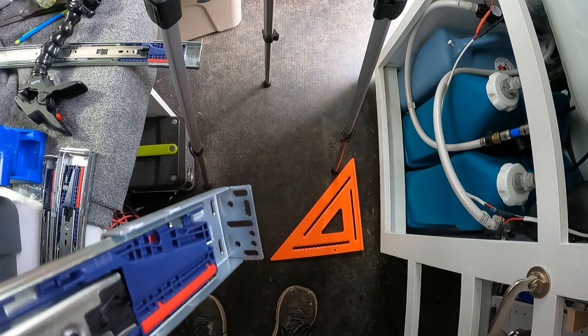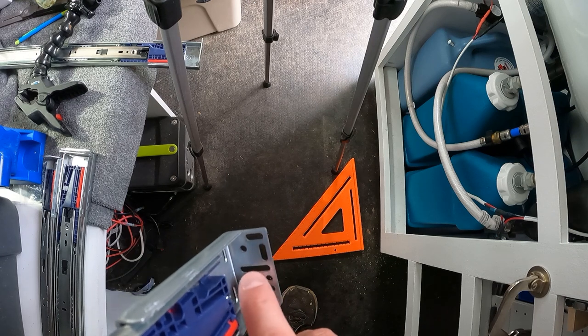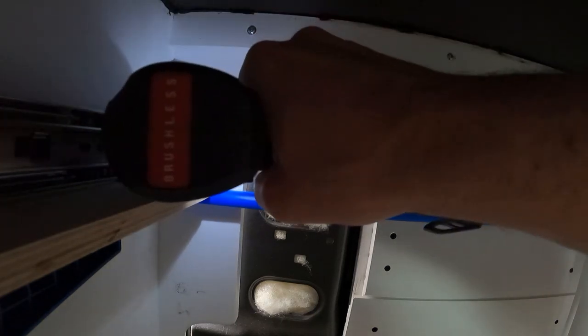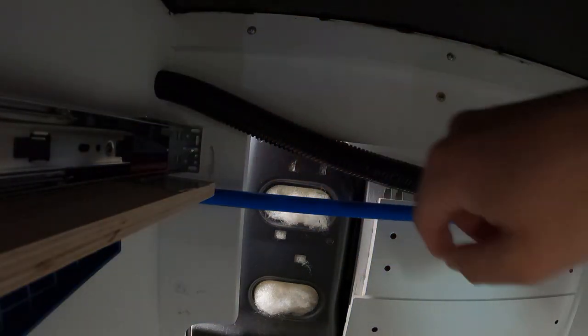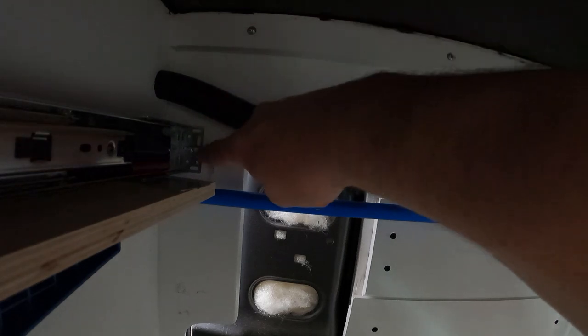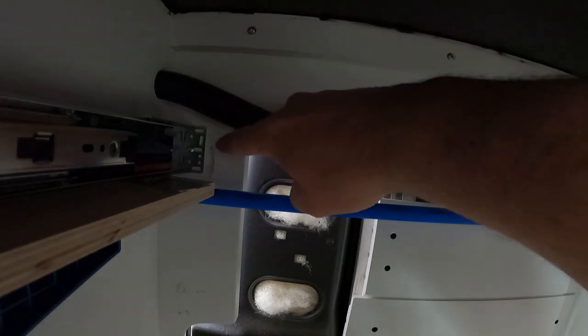When we go ahead and screw in the bracket, there are these extra long slots in the bracket in the back. Using the one in the middle, you'll have play on the screw head as long as your screw is not tightened down all the way. We'll go ahead and put a screw in that middle track, trying to keep it somewhere in the middle and not tightening it down all the way. As the drawer goes in, you can see it goes back and forth within that track. The height is pretty much set, but the side to side play with that track will allow us to adjust. Once we put the drawer in and out a few times it should settle in the right spot. Now we'll go ahead and get the drawer and figure out installing the drawer slide into it.